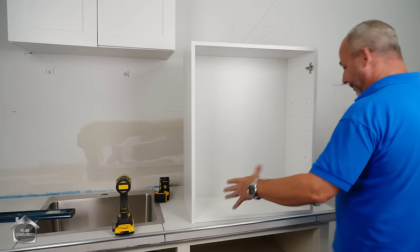Of course, the screw comes from the backside. And same thing, start this on reverse. And when you hear that click, you go in forward and you drive it in. Okay, remember, the metal in here is a lot stronger than the metal here. So if you're cross-threading, the drill is so powerful, it'll force it in there and then just shear the screw off. Now you're stuck with a piece of screw inside your handle and it's useless. So always go backwards until you hear that click.